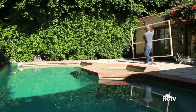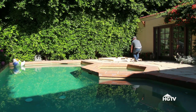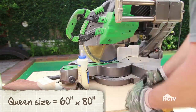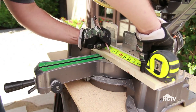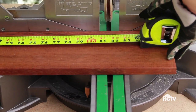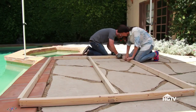First, you're going to need to figure out where the daybed's going. Do you have a corner of your yard that's unused space? I'm building the frame out of 2x3 boards for a standard queen size bed, which is 60 by 80 inches. I'm going to allow for an extra inch on all sides for bedding, so my measurements are going to be 62 inches by 82 inches. You also need to put a 2x3 board down the center long ways for some support for our mattress.